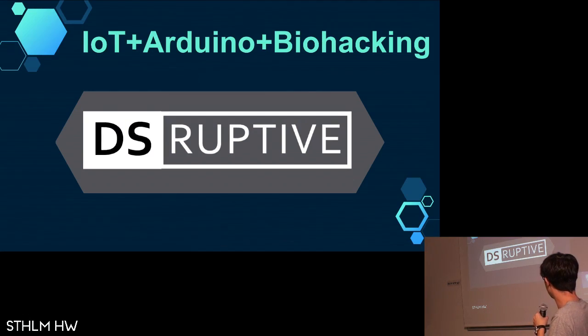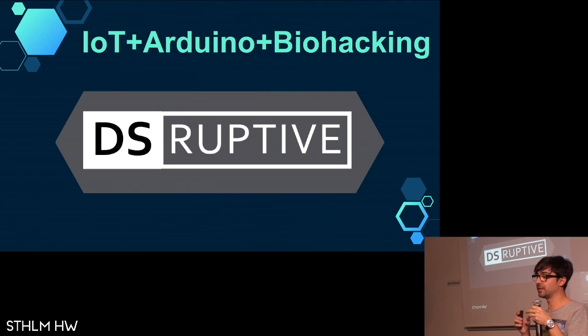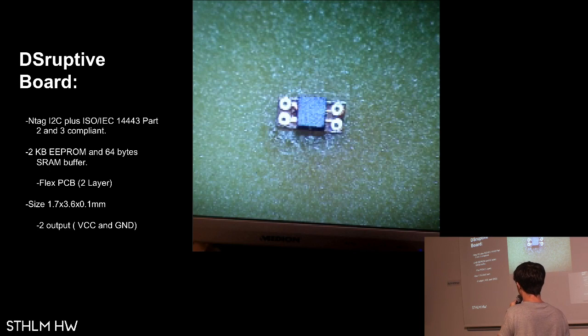And thanks to Maker Reason, I decided to create this project, Dsruptive, where I was trying to mix IoT with the Arduino idea, since I had been working with Arduino for a couple of years, and of course in terms of biohacking. Right now there are not many tools for people to create hardware that can be embedded in a biocase or in any kind of implantable device. So with the idea of integrating sensors inside the body in a low-cost way, I decided to design a board this size. To give an idea, the board is 1.7 by 3.6 millimeters. It's really tiny. I have to use a microscope now to show it.